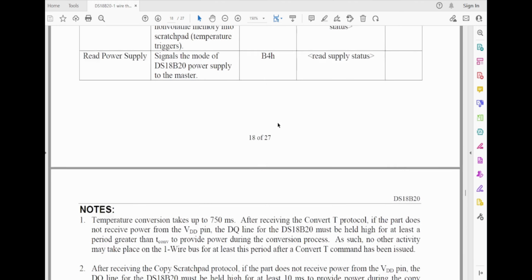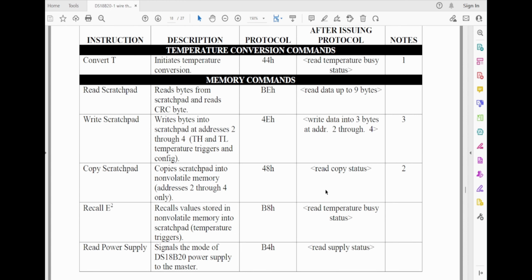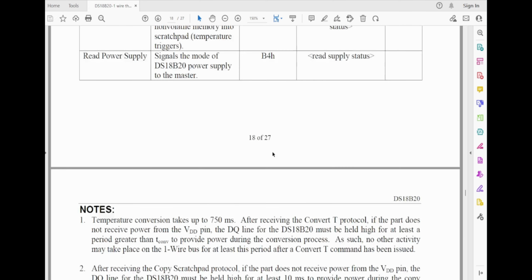And yeah, I was playing around with this earlier, the other day, with the logic analyzer, and you can actually see the library just doing, are you ready? Are you ready? Are you ready? You're ready now. So you can see it's sending B8, B8, B8, B8, right, BE. Then goes back up to 44. Wait, read. So you can see it ticking over quite happily.